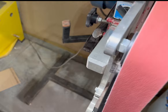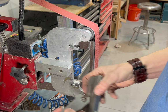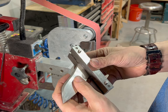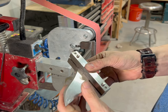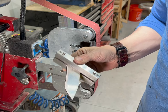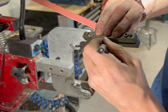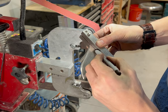What I usually do is whenever I do a new blade, I put all brand new belts on, and then I use those belts after they've ground the blade to do the profiling and non-critical operations on the next knife. Right here I have this file guide — got it from Bruce Bump — I don't grind with these anymore, I never did end up using them that much, but it's super handy for marking out your grind lines. You just put this on and then mark on both sides and you have perfectly even lines to reference while you're grinding.